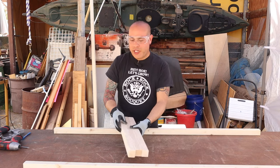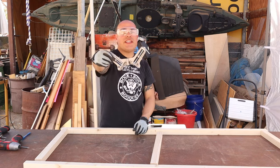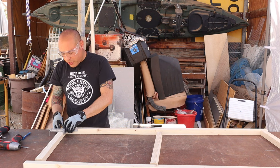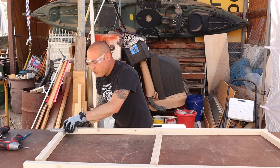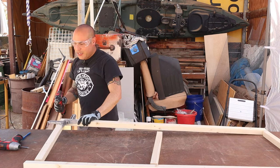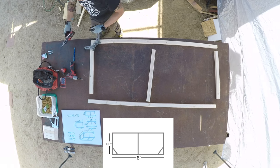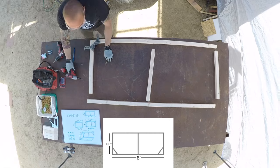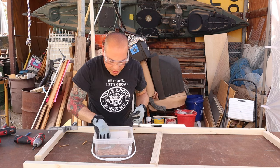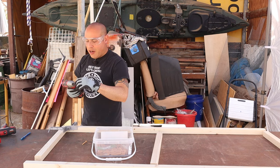So now we'll take our five-footers with our 21 and a half inch cross beams and we're going to start connecting the corners together using this cool corner clamp — it's made by Pony, sold on Amazon, and I'll leave a link in the description. They just twist right here connecting your corners and guarantee you a 90-degree angle so you have a perfect square. Now we're just going to go ahead and start pre-drilling some holes. I'll do two vertical ones in each corner to hold it nice and tight. I like to pre-drill because if you don't, chances are your wood would end up splitting if you just go in with a screw.